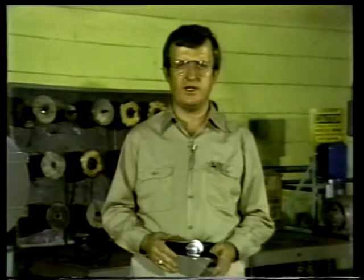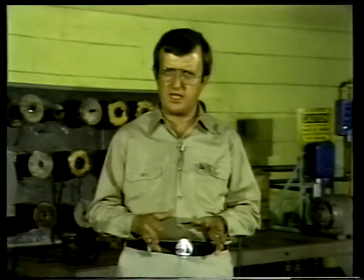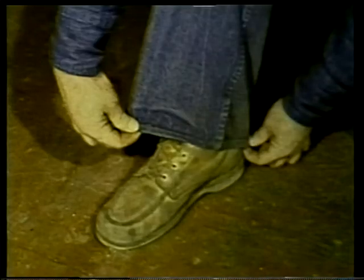Certain types of clothing are considered safest to wear during welding. A long-sleeve shirt buttoned to the neck should always be worn to protect against flying sparks and bits of metal. Cuffs on pants and patch pockets on pants or shirts can catch and hold flying hot materials and should not be worn during welding. High-topped leather shoes that fit up under the cuffless pants and a hat under the helmet are added protection against burns.